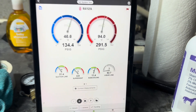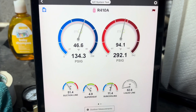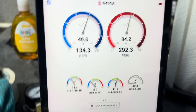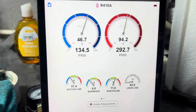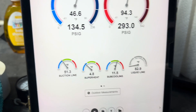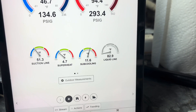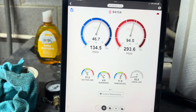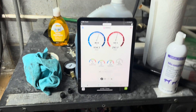I'm not a huge geo fan and I don't work on a whole ton of them, but look at this guys — it is almost 100 degrees outside and this thing is purring right along. Any water-cooled condenser, they just run good. It cools that refrigerant nice and good. We have a 51-degree suction, 11 degrees of subcooling, 293 head pressure. Look at our liquid line temperature — 82 degrees, 83 degrees. That's crazy. You just can't really beat a good geothermal system in the middle of summer. And it's the same thing in the winter — it's all the heat you want. Some of them aren't even installed with emergency heat because you get so much heat with it just running normally.